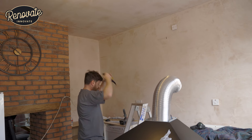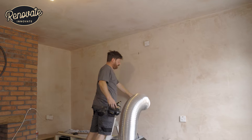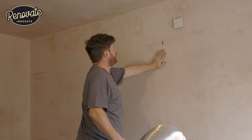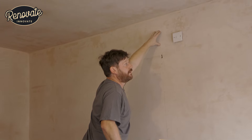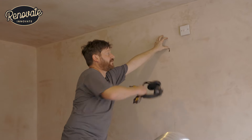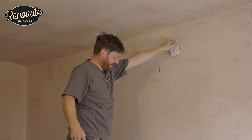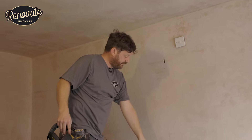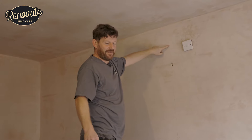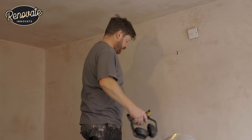Change of heart — I was thinking of drilling through the lintel, but of course it would have been okay if all this had been blocked up with blocks or bricks, but we can't just cut through this lintel. This will be all unsupported here yet, so we're going to have to drill a little bit higher. There's a lintel — should be a 3-inch lintel there. I'm going to drill a little bit higher up there. I've checked these cables — these are running down there. There is a feed for the electric hob running down here; we're making sure we've missed that. We're going to have to drill a little bit higher and this flexible ducting will stretch and go all the way through.